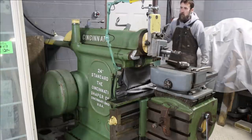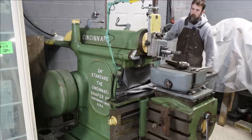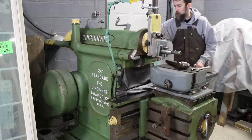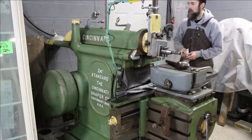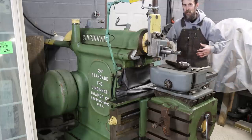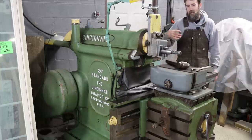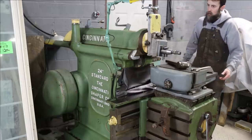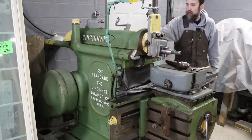So I've got an easy two weeks of just machine cleaning that I'll have to do. The old shaper, she fared pretty well underneath that tarp, but I soaked her down with oil before I covered it up. But still, a machine like this, as big as it is, does not do well with rapid temperature changes. They tend to get water on them to condensate, and they'll rust no matter how hard you try to stop it. So we got a lot to clean up.